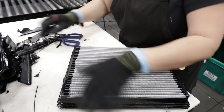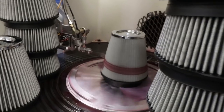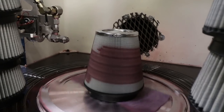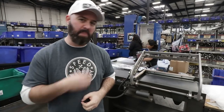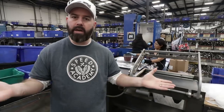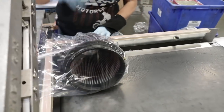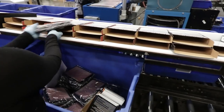You're left with a finished filter. The next step in the process is the filters come over to the oiling station. As you can see, it sprays oil on the filter in a defined quantity. It looks like it hasn't coated the whole filter, but if you imagine a glob of butter on your shirt — it'll spread out over time, and it's the same with the oil. It'll fill in all that media in about a 20-minute period. Once it's sprayed, it gets packaged up and moves on down the computerized line. These filters are ready to go out, so they're being boxed up with stickers going in.